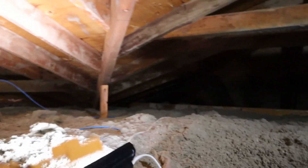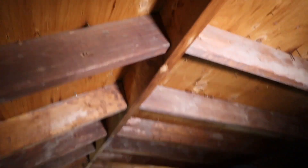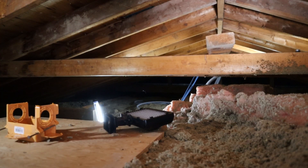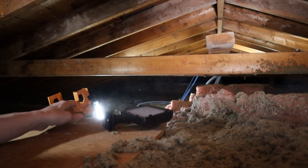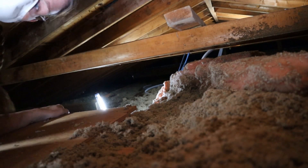I really wanted to have my GoPro back by now, but that's taking a long time to get fixed. This is going to be a little shaky — I'm very sorry, please just deal with it. If you ever climb up into your attic for the first time, be mindful that you have to keep your weight spread on the beams. Do not put your full weight between the beams — if you do that, you're going through your ceiling. And just for added fun, let me show you what the ceiling looks like everywhere you look — just filled with nails.